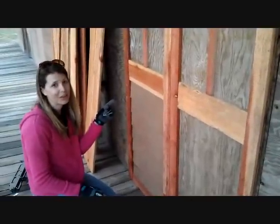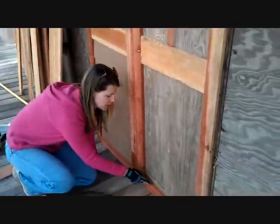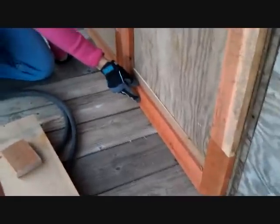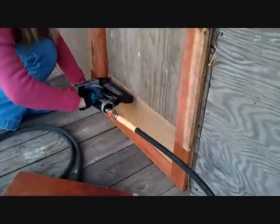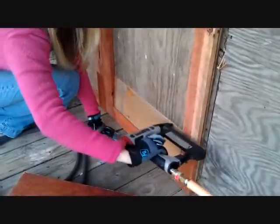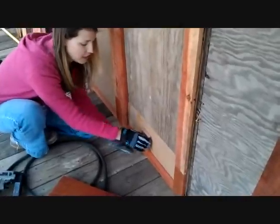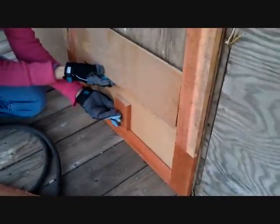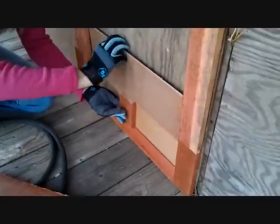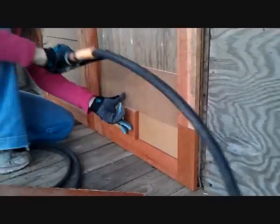All right, so we're working on the door right now, and I wanted the bottom part to be louvered, and I thought I'd show you guys how we do it. So the first thing you want to do is add a little strip thinner than your bottom piece, wherever you're starting from. So this is your thinner piece right here, and you take your larger piece, and you stick it right on top there, and it goes in really good. You screw it in, nail it in, glue it in, whatever. Glue and shoot! And then you take a little wedge or something like that. Depending on the height you want, like if you want them really small, you could put it that way, but we're going for this size right now. So the next thing you do is you stick it on there. And see, it kind of kicks it a little bit, so it gives it an upside down stair stepping effect.